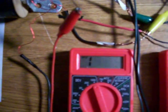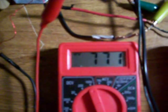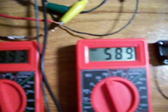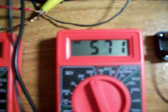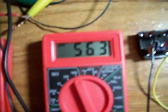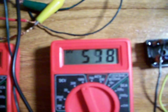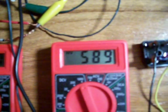This is the back EMF from the coil — it's a little over a thousand volts. And this is the voltage from the winding on the outside going through a rectifier — a little over 550, almost 600 volts.